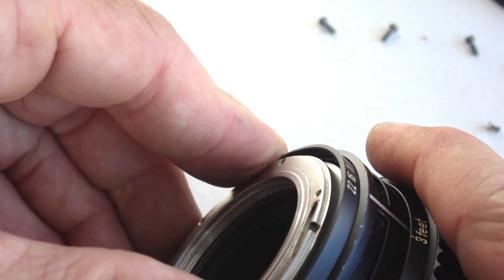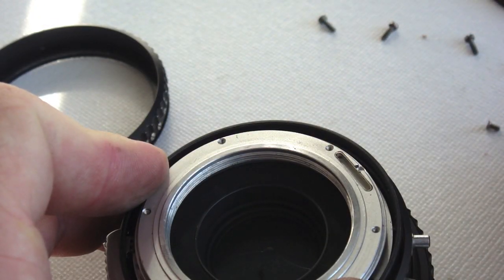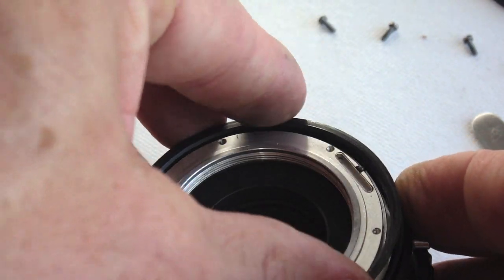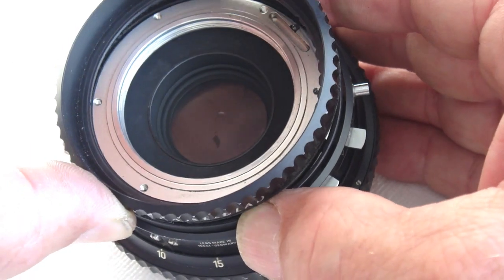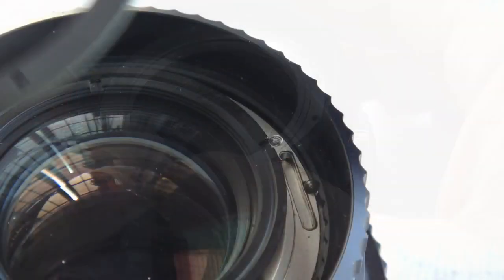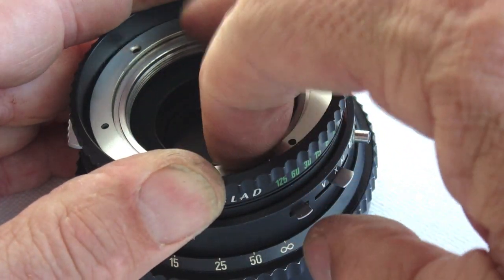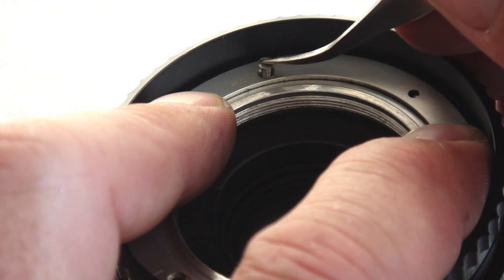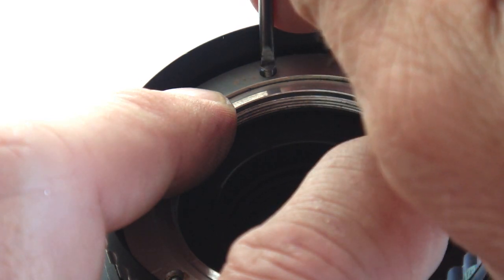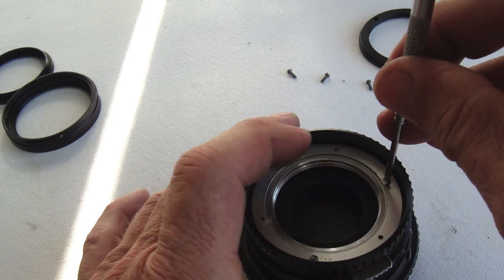Next, seat and test the aperture ring, making sure that the aperture depth-of-field markers are functioning. Now seat the shutter speed detent bearing and place the base of the shutter speed ring into position. Sometimes it sticks to the bottom of the shutter speed ring, but if it separates, it needs to be installed before the shutter speed ring, making sure the click stops will align and function properly. The retaining plate of the shutter speed control ring has a cutout that needs to go over the shutter speed click bearing. If it's not installed properly, the shutter speed dial will be stiff. If aligned properly, the dial works smoothly. Put the three countersunk screws in as they are aligned.